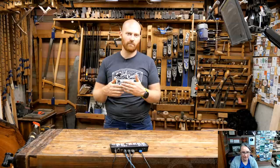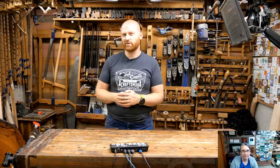The only time I think about secondary bevels, like a back bevel, is doing the ruler trick. If the back of the plane blade isn't perfectly smooth and flat, then I might do the ruler trick on some plane blades like that. But on low angle planes, it kind of defeats the purpose, because you have it at a low angle to keep that low angle, and if you put in a few more degrees you've made your angle higher. At that point, it's just as high as a high angle plane. So I don't do that.